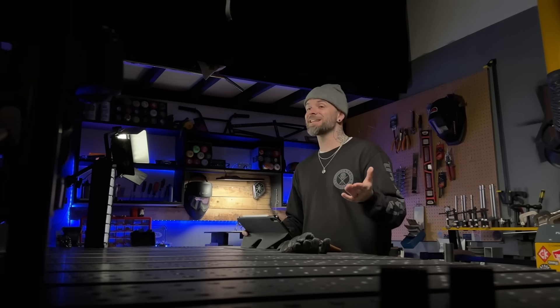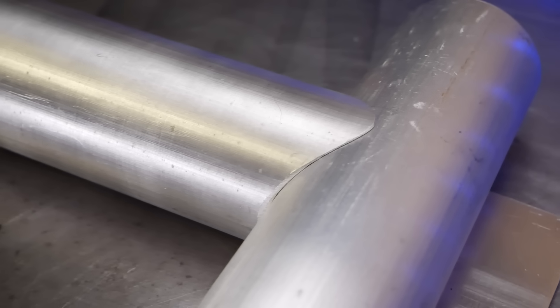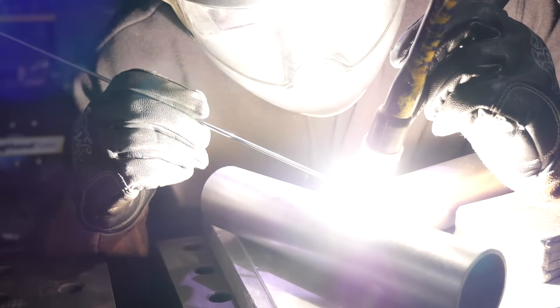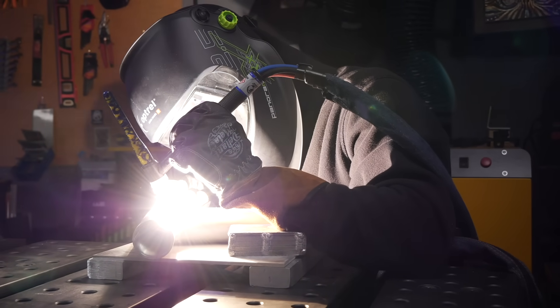At this point I recommend you check everything to correct any distortion — it'll be impossible to fix if you don't take care of it at this stage. This is the point of no return. A quick disclaimer: if this was a real structural part that needed structural integrity, there is no way I would allow this to happen. You want real base material to be properly coped and prepared. Filling up a gap like this is not something I'd recommend if the piece is going to be subjected to stress, strain, or impact. As a PSA: always take the time to properly align and fit up your pieces so you don't have gaps to deal with. Distortion will be more minimal and the welding will turn out much better in integrity and appearance.